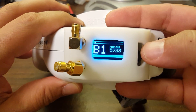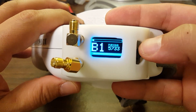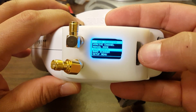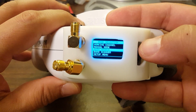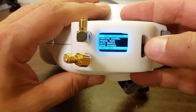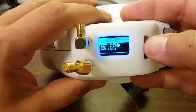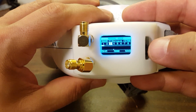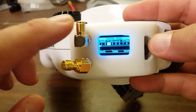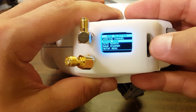It's hard to be too critical of that. When you're only 5 or 8 MHz off, the difference in channel strength is very small. So you just have to accept that auto search and the band scanner won't exactly give you the right channel for either of these devices — they'll get you close though. If we take a look at the setup menu — I'll be a little quick about this because it keeps jumping back to the screensaver — you can calibrate RSSI, which is something you need to do one time when you first get it so it's able to switch diversity correctly. There are instructions for that online.